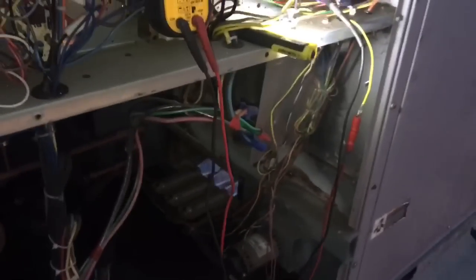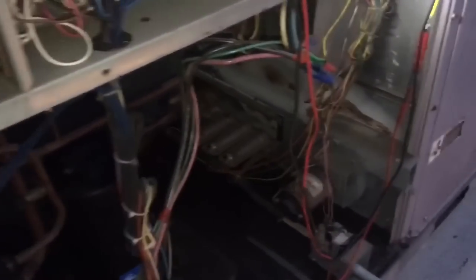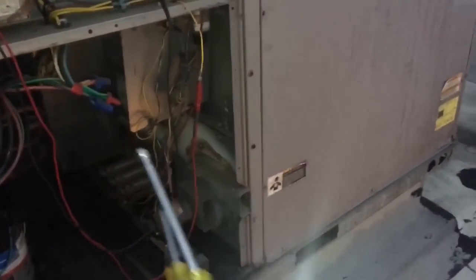The DL 429 makes heaters work — magic! Now let's clean up that flame sensor. I'll pull it out of there, I'm gonna turn it off so we can get down in there. There's a door right here, just one screw at the bottom front, and the panel slides out. You pull that panel out, now we can crawl back here.